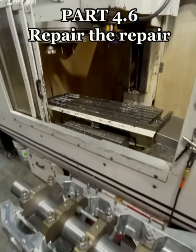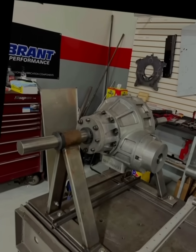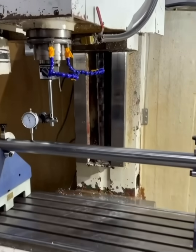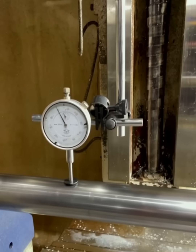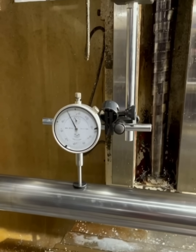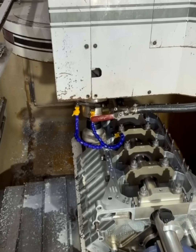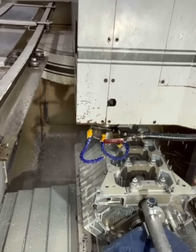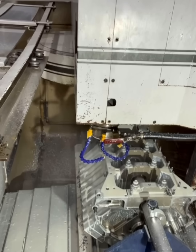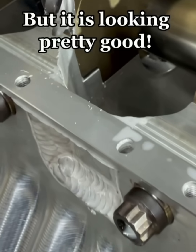Today was the day I was going to throw this thing up in the CNC and try to finish up some of the machine work. I was looking for my main bar for setting it up in the machine and found it over in the chassis shop in the rear end, so I had to take that apart. Once I got it back, I had to indicate in where I'm going to hold this block. That ate up some time. Then I started to surface the top of the pan rail, and then my coolant quit working, so I had to work on that. Now I can start machining it. And this here is a picture of my wife — isn't she beautiful? The block is coming around, but not quite as beautiful as my wife.